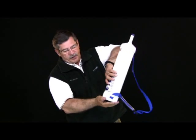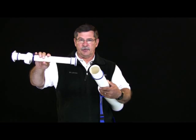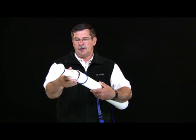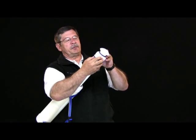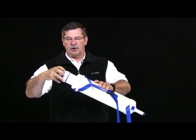Sometimes you may have to tip it upside down, but grab this cylinder and pull it out — this is the inner pump. Remember the O-ring we took off — that's the cover O-ring that goes over the top. Replace it by slipping it down on the pump. Now that we've serviced the plunger assembly just like on the K100 or K200, replace the plunger assembly into the pump, make sure it's in properly, and line the holes up so the screws match. Replace the screws, then roll the cover O-ring over the top of the screws. That O-ring covers the screws but also creates a cushion when locking everything together.